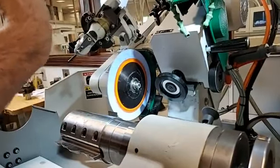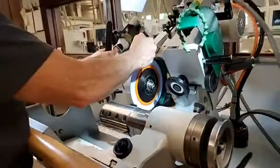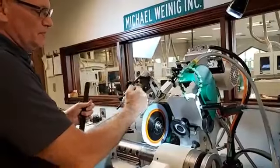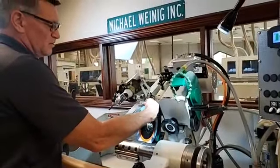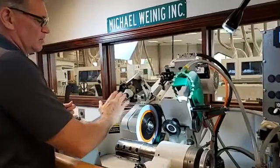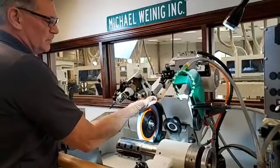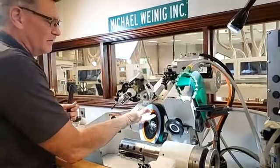If somebody who had some pretty big forearms goes to lock this thing in place, the next person might not be able to get it off. Also, if one person squeezes it over too far, then they position the wheel in a different place, so that when our grinding or our wheel dresser comes over to reshape this wheel, it's misaligned with the wheel itself.